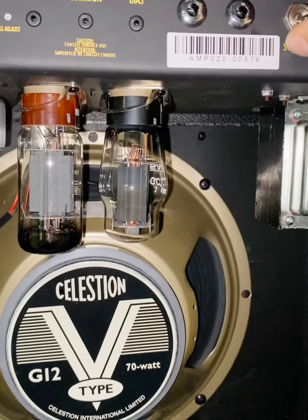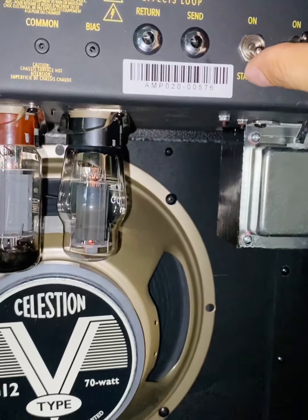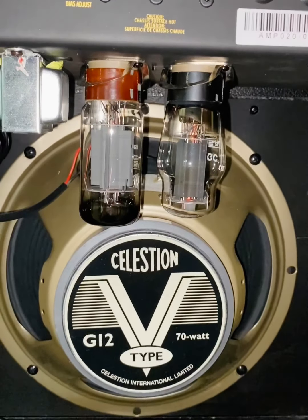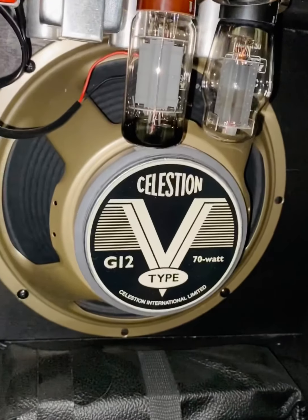On the last video, as soon as I flipped it off of standby, it started motorboating. Let's see if it happens this time with the new tubes in there. It's on. No motorboating. Normal hissing.